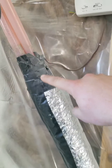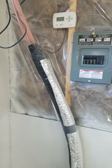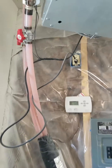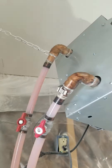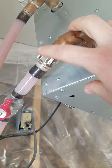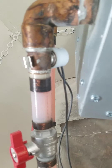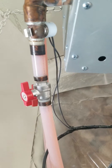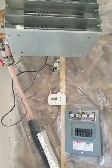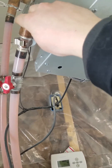To control it, I have a thermostat line running all the way inside to the control relay, which turns on the circulator pump and circulates the hot water up through the supply. This is the return, and there's a little thermostatic switch I put on the return so when it heats up to about 140–150 degrees the fan will kick on.